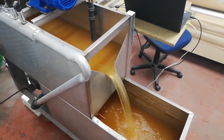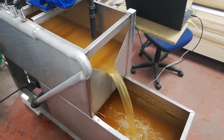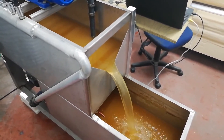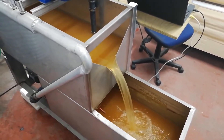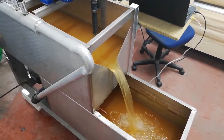The layout of the equipment shows the top tank, which is what the turbine discharges into, and that flows through a V-notch into the bottom tank. This allows us a second way of measuring fluid flow. The bottom tank is the tank from which the pump is drawing water, which is then pumping water under pressure up the pipe into the turbine.